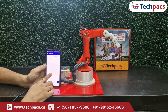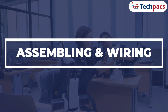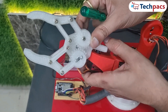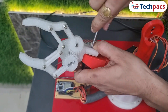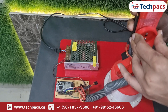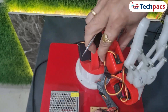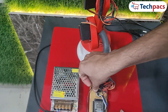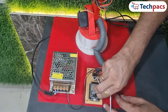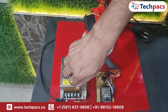That's all about the demonstration of the robotic arm. Now let's discuss the assembling and wiring step by step. Start by mounting the servo motors onto the robotic arm chassis, ensuring they are securely attached to allow precise movements. Then connect the servo motors to the ESP32 module, with the signal wires connected to specific PWM-capable pins on the ESP32. The power and ground wires of the servo motors should be connected to the 5V 5A SMPS supply.